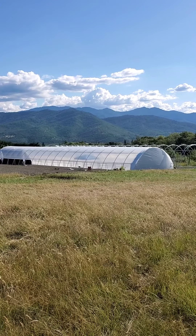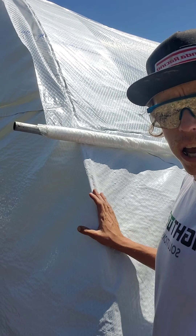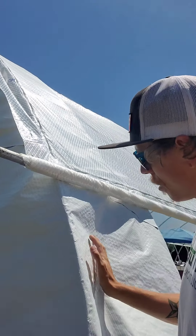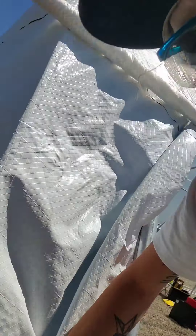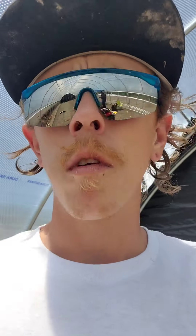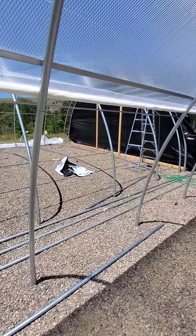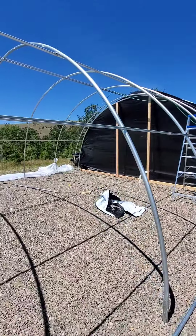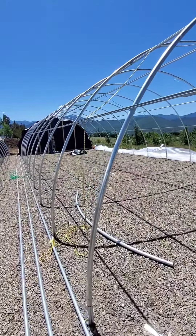There it is, guys. I had to cut a bunch of segments. You're going to see that on this last panel underneath it, what you do is pull your end wall tight, grab the plastic up and pull it, then forever wiggle wire all the way down. I'm going to do some telescoping arms on the greenhouse. The boys have all the ropes run, the end walls tacked, the channel on top, on the sides, everything hooked together — 100% ready to pull.